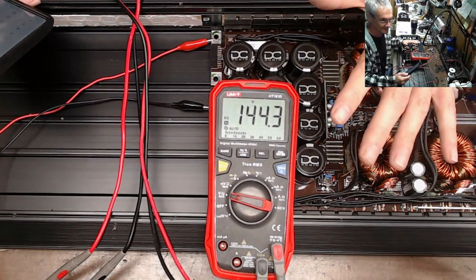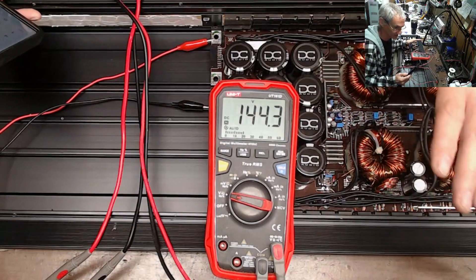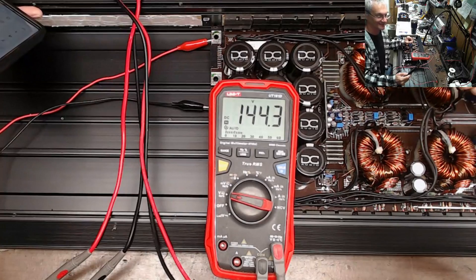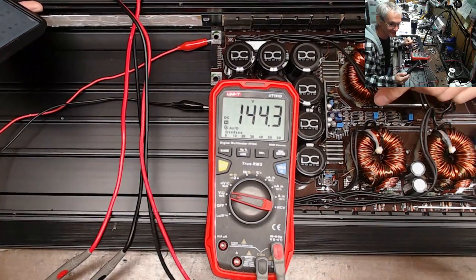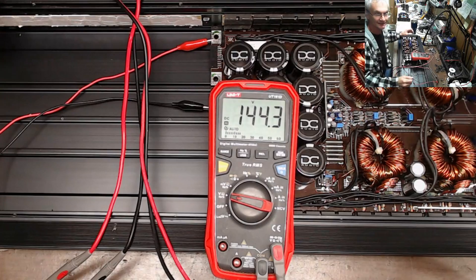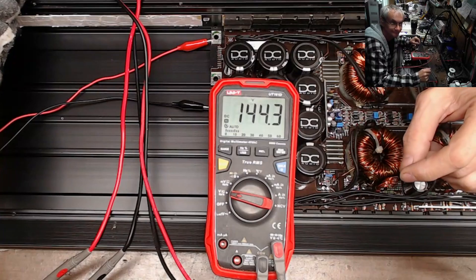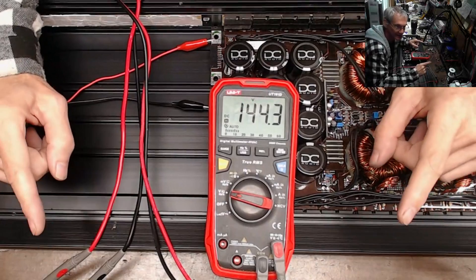If you are running a 16-volt lithium system and its off-charge state is 16 volts — I don't even know what your on-charge state is, but if your resting voltage is roughly around 16 volts and you burp these boards — you're going to have 192 volts positive rail and 192 volts negative rail. So you're just shy of 400 volts peak to peak. That's the problem. That's why I will not service the DC-10K.